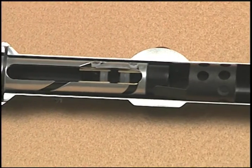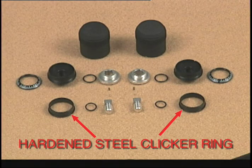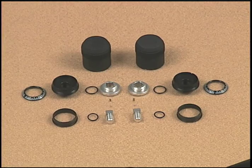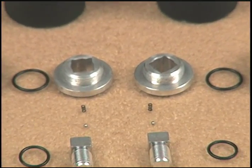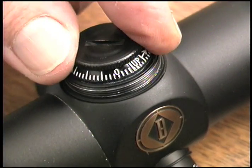The front end of the guide tube assembly is held by two springs against the windage and elevation adjustment assemblies. The windage and elevation adjustment components are also specifically engineered for precision and durability. Burris adjustment assemblies feature a hardened chrome steel clicker ring to provide a lifetime of dependable service without any wear. Some other scopes do not have any clicker ring, and some others use aluminum, brass, or unhardened steel. A hardened steel ball bearing under spring tension rides against the clicker ring so you can see, feel, and hear the positive clicks. The adjustment assembly is sealed internally and against the scope outer tube so that the scope remains waterproof even without the adjustment caps installed.